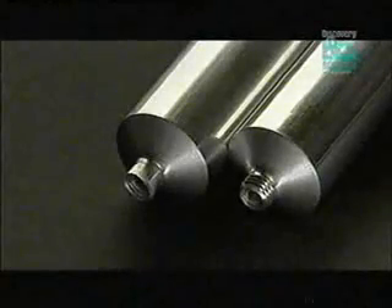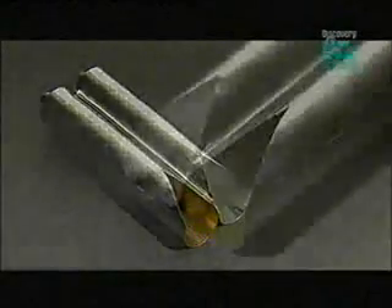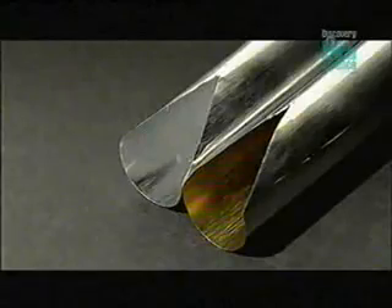The neck on most models remains sealed until the consumer pierces it. Another company eventually seals the tube by rolling up the other end after they've inserted their product. After heating the tubes to soften the metal, they move through another machine where nozzles spray the insides with two coats of epoxy lacquer, creating a protective barrier between the aluminum and the eventual contents.